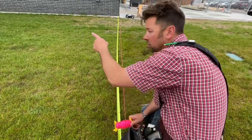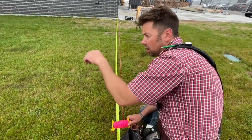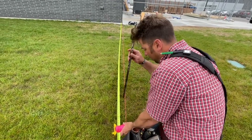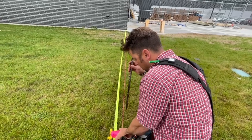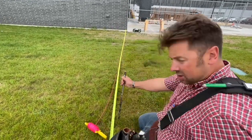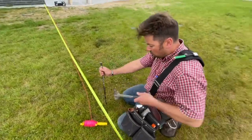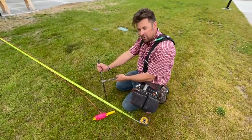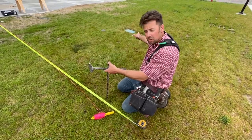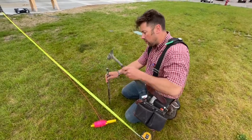I could also do my Pythagorean theorem here and check my cross corners — that would be a way to double verify. I'm going to set this pin to the outside of the line at 20 feet. This is a 24-inch stake. I know I can't pound this more than 12 inches into the ground or I'd have to call for a locate. We've got a significant number of sprinkler heads here, so those will obviously be concerns.